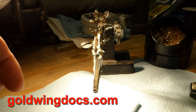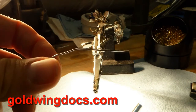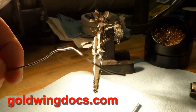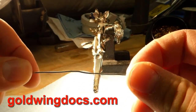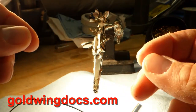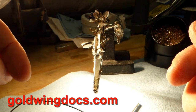Keep in mind lead is a neurotoxin. This is a lead-tin solder — I know there are non-lead solders, the kind they sell in California and similar, but they don't work as well. There's just nothing as good as 60/40 tin-lead — 60% tin, 40% lead. It works better than anything else, and inside the middle of the solder wire is where the rosin is. Since this has lead in it and it's now on your fingers, don't go eating a sandwich after handling this stuff. After you've done soldering, go wash your hands — get the stuff off. You don't want lead in your blood. Hope this has been of some help to you.